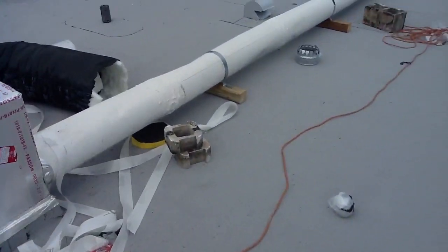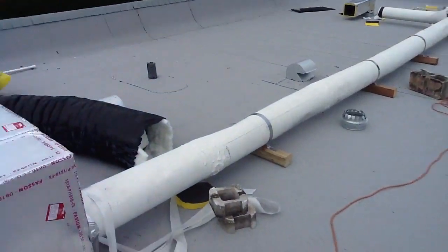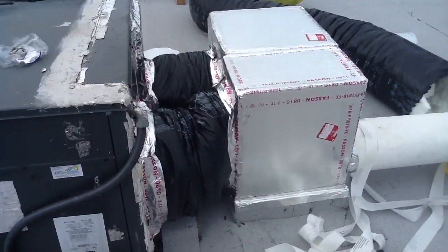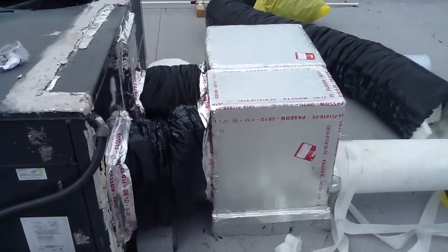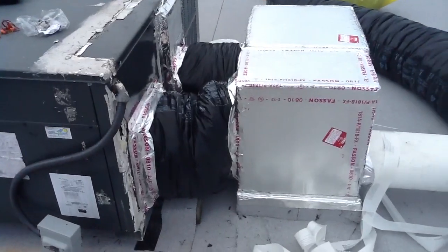What happened is they actually did a new roof on this particular roof here, so we were asked to take this down. We don't have much to work with here, so we're going to replace these boxes with inch-and-a-half antimicrobial insulation, and then we're going to seal and mastic everything, bringing everything up to the new Florida energy building codes.